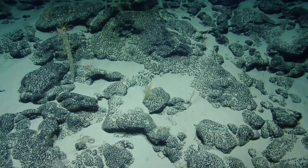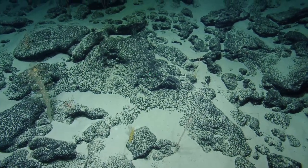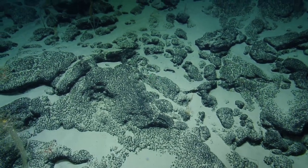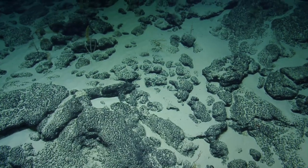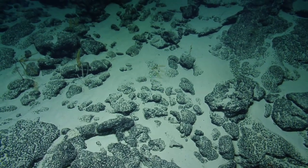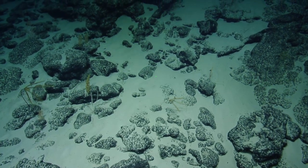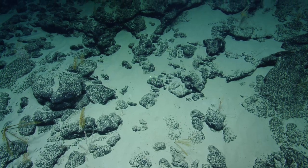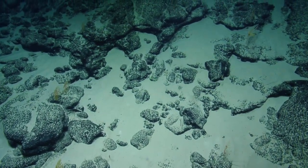Wow. And then you've got to balance the size of the ROV to the depth. The deeper it goes, the more foam you need, and the foam weighs, so you need a bigger frame to carry the foam, and you need more power to move it through the water. It all adds on top of each other. If you're going single body, you need a specialized heave comp winch. And don't forget the control vans. You're going to need some of those, too. Right. Tether management systems.